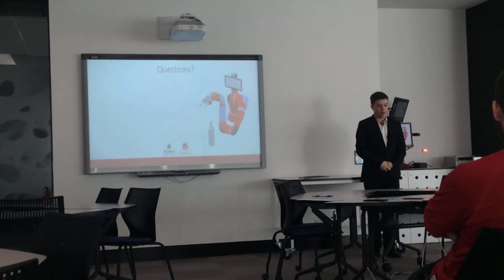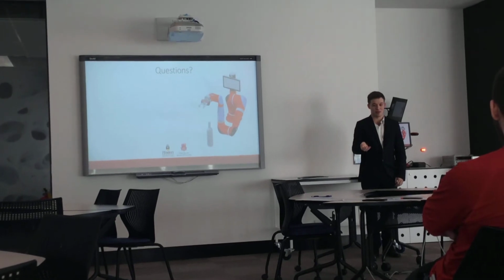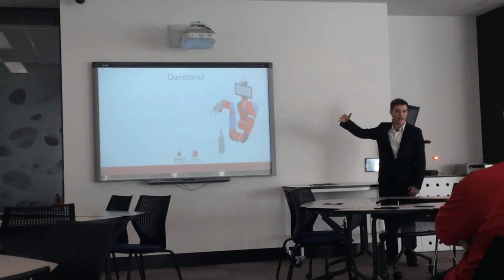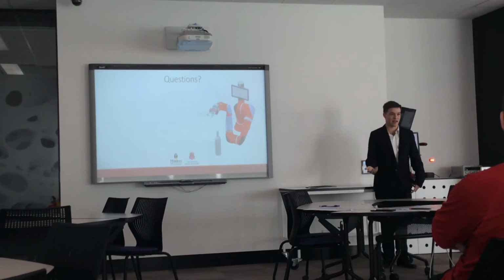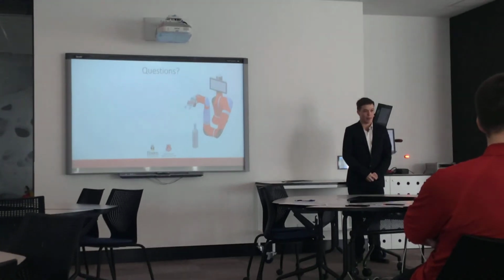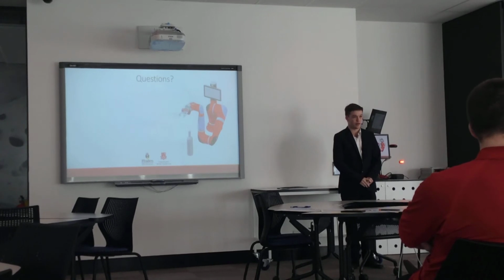Okay. And one thing I also considered in the project is that using a robot that fast isn't really compliant with Australian standards, because the robot is about this level, so it can contact my head, it can contact my ribs. So that's something else that I considered. So that would actually make the cycle time longer, if anything. Yep. But it wasn't processing time or anything. It was just the mechanics of the robot. Interesting.